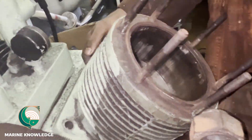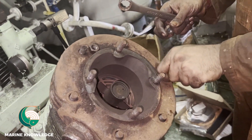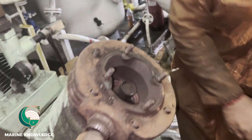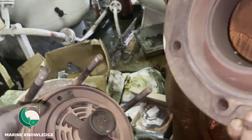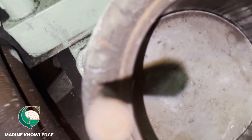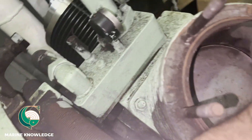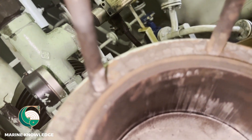The liner is very easy and fast to remove. Just open all the nuts, lift the cylinder head, give it a little shake, and you can remove it. You can see the condition of the cylinder head — it is very old. The reason is this compressor has been kept idle for a long time. This is the LP valve, and you can see the condition of the liner. The liner is damaged and we are planning to change it. The piston is also damaged and we are planning to change that too.